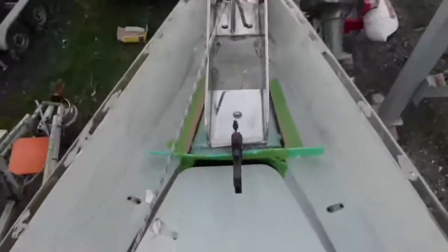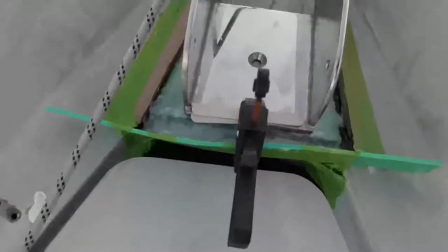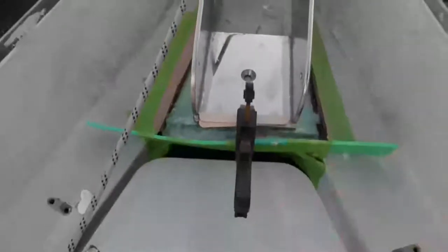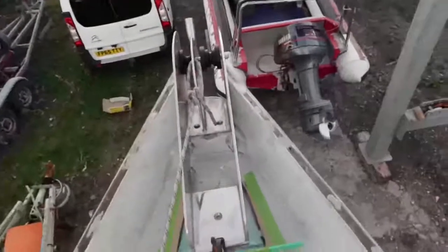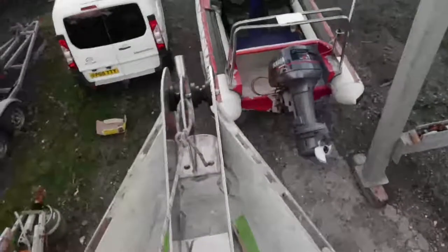This little barrier is warped in the heat. We'll just smooth off that back edge so that we can put a new lid on our rope locker here. And then we'll be able to bolt the bow roller in place. We'll just bed it on some good quality UV stable sealant and that will all be in place.